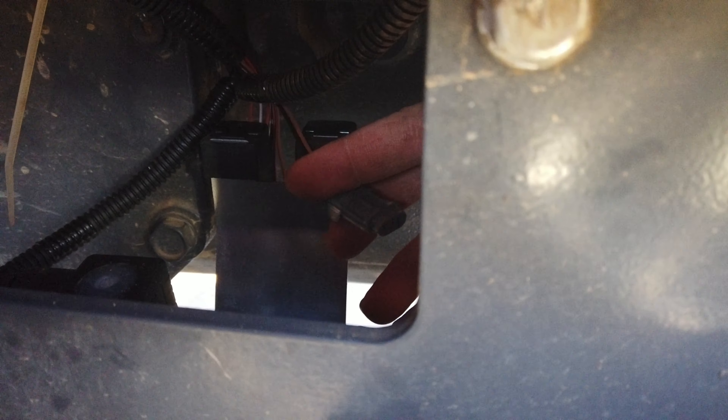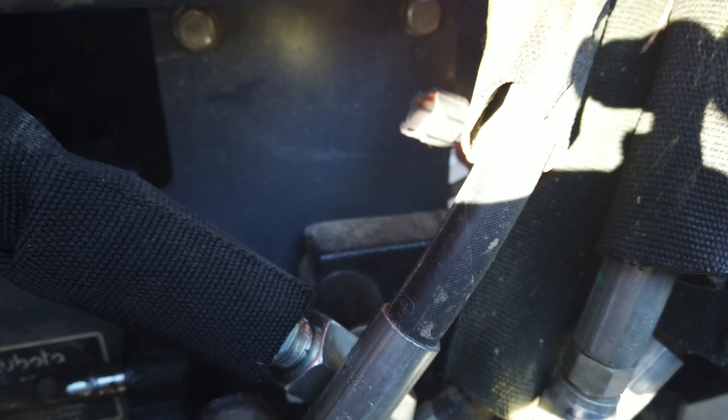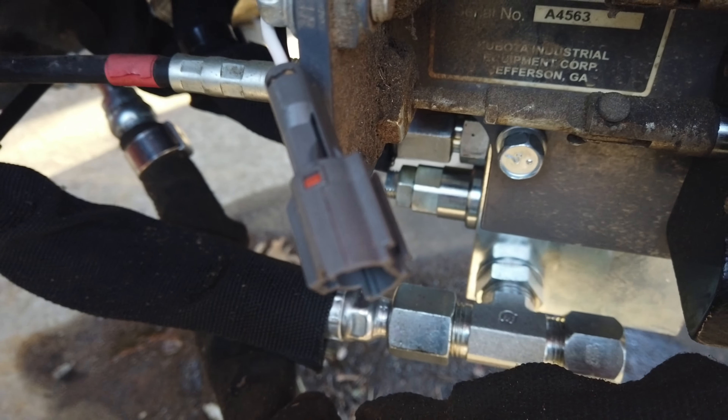You can see that little pigtail hanging down there. That pigtail goes to the front of the tractor or the front side of the solenoid. We've got the pigtail coming off of the valve itself and that's what's going to plug into your harness back here in the back. The wire that doesn't have any wire loom or insulation on it — that's going to go to the connection at the front of the tractor. The other wire, this one has wire loom on it all the way up to the plug, and this one is going to go into the pigtail at the back of the solenoid assembly.